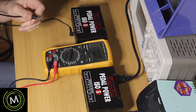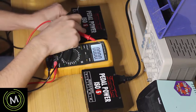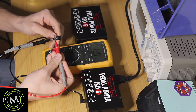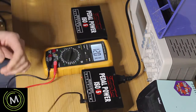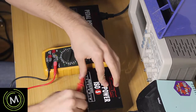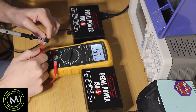Here is the output I'm seeing from the left ISO5. From the normal ISO5, this is the 12-volt output, and as you can see it reads 12 volts. If I swap over to this other unit and measure it, I get something like 24 volts - 23.3 volts. So there's obviously something wrong there, and we're going to open it up and see what we can find.